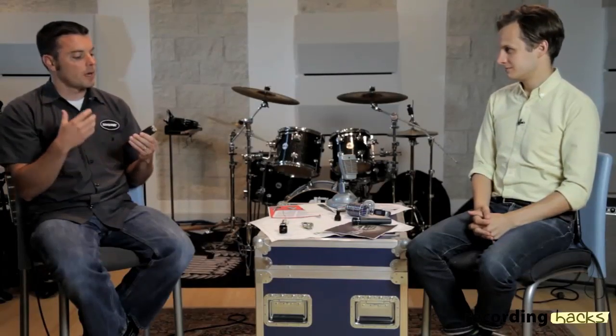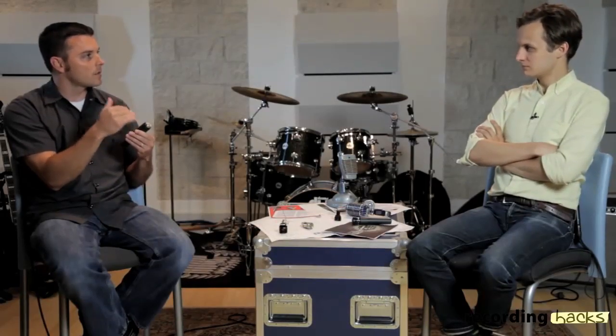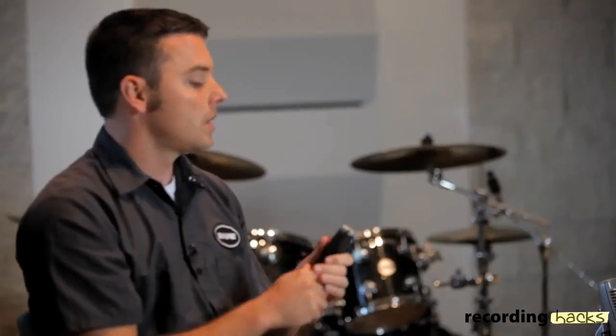And all those resistances and values is complex math and tuning. But by creating different cavity volumes and different resistance values of that cloth, or the spacing of the holes, that's how we tune the microphones. We tune the polar pattern of the microphone, whether it's a cardioid or a supercardioid or a hypercardioid microphone. Or we can just close all the ports up, let all the sound enter the front of the diaphragm, and it'll be omnidirectional.